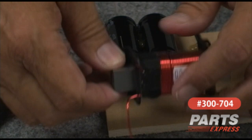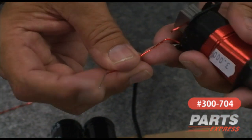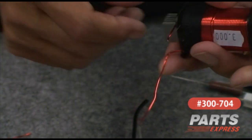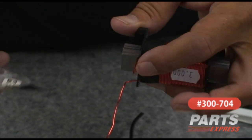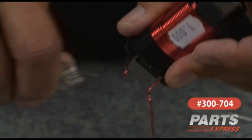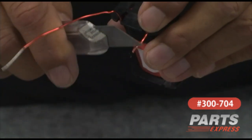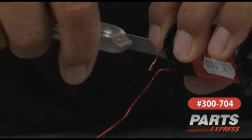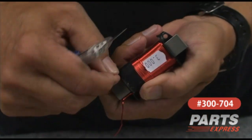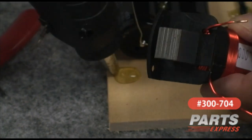This red coating on the coil wire is insulation. You can see the end of this wire has been tinned, so it has a silver appearance, but we cannot solder to this insulation. I'll use a carton cutter and scrape away that insulation — right underneath it is bright, shiny copper. We've got to get all of that off so we have plenty of clean copper to solder to. Then we'll glue the coil down right in front.